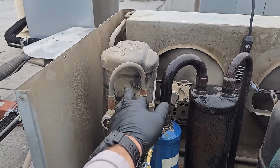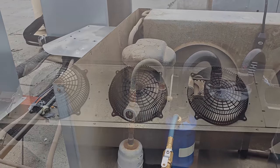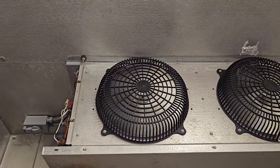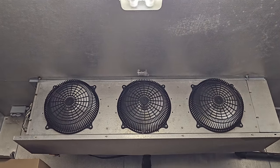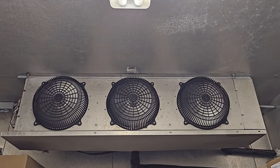I'm going to keep watching the system operate for a minute, then we'll do a pump down on the receiver and check the actual liquid level. The evaporator fan motors are running now — it's getting cold in here, so that's a good sign. I've got to go get my thermal imaging camera and we're going to check that liquid level.